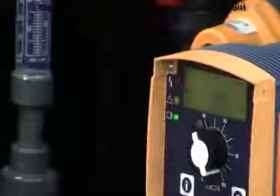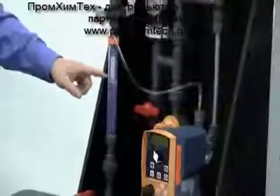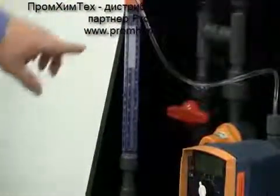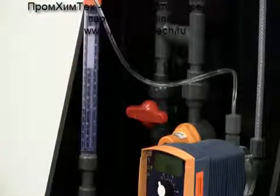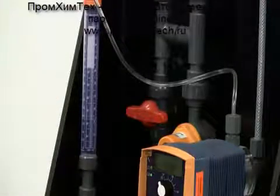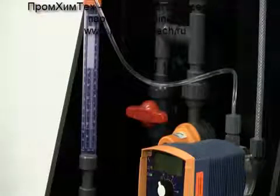The calibration column is usually graduated on one side in a timed event — a drawdown of so many gallons per hour for a 30-second or one-minute drawdown. We want to pay attention to the true value, the volume amount graduated in milliliters. The longer we let this run, the more accurate our calibration becomes. Being off one milliliter in a 10 mL drawdown is 10%, whereas one milliliter off in 100 mL is only 1%.